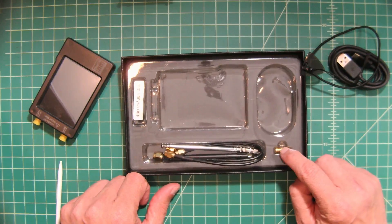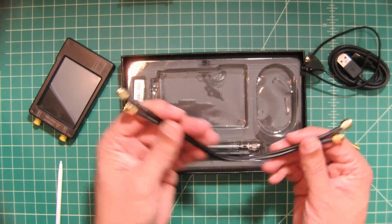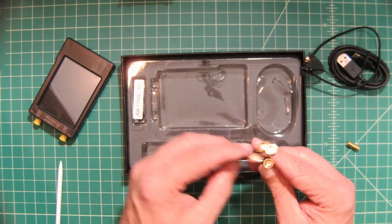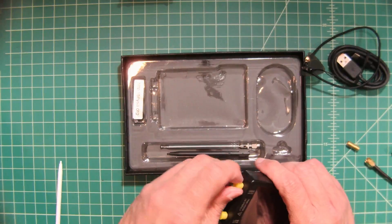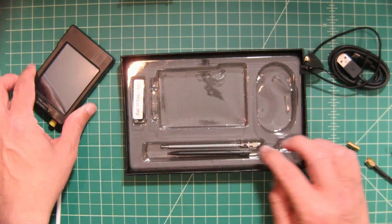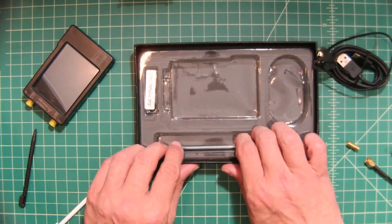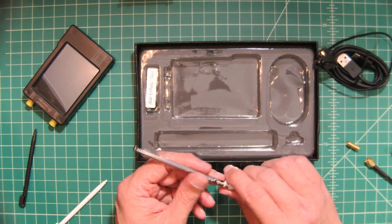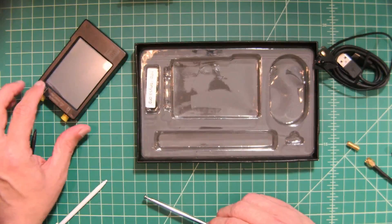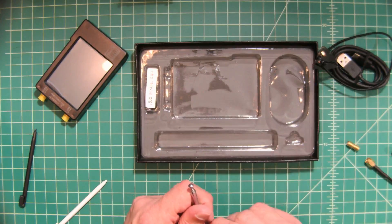It has a through connector standard, handy for connecting coaxial cables together. It comes with two coax cables with SMA male connectors that you connect to the SMA female ports on the device. It also comes with an antenna — you just connect it to the SMA port and you can use the TinySA to detect RF that is actually in the air, without needing a coax feed going directly into the TinySA.